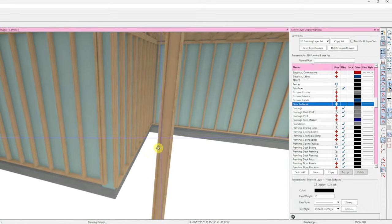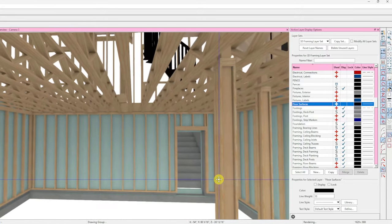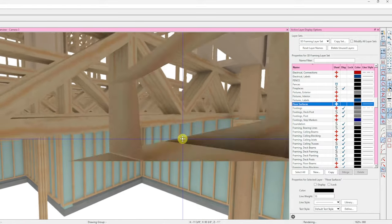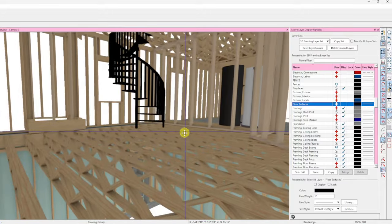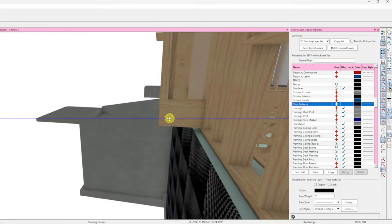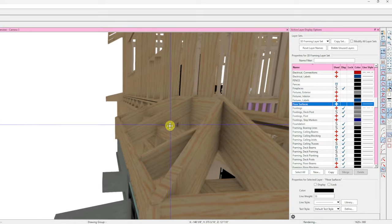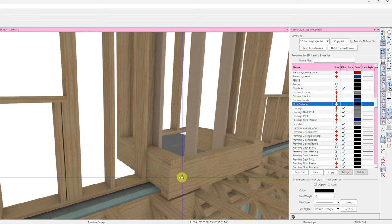Around here these are just posts where electrical is wanted — looking at some remodel boxes put into here for the outlets. They'll show up on the electrical plan. Posts on up, catch beams and such going across. You'll be getting an AutoCAD plan to go with this, but this is a good way for me to explain in 3D what's in 2D, such as the stabilization of this small fireplace on the exterior — it goes up to here with a little roof and then it's just going to carry a gas insert.